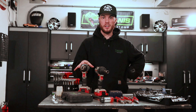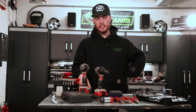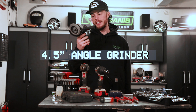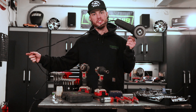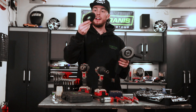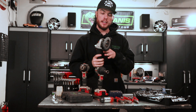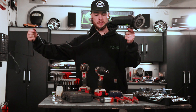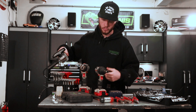Now if you want to start cutting, shaping, and welding, you're going to need a couple different tools. I'm a big fan of my 4.5-inch angle grinders — we get ours from Harbor Freight, they're corded, they're $13, and they're awesome. I have a flap disc, grinding wheels, and big 4.5-inch cutoff wheels that all swap on. I have two of them so I can keep one set up with the flap disc and the other with a cutoff wheel.